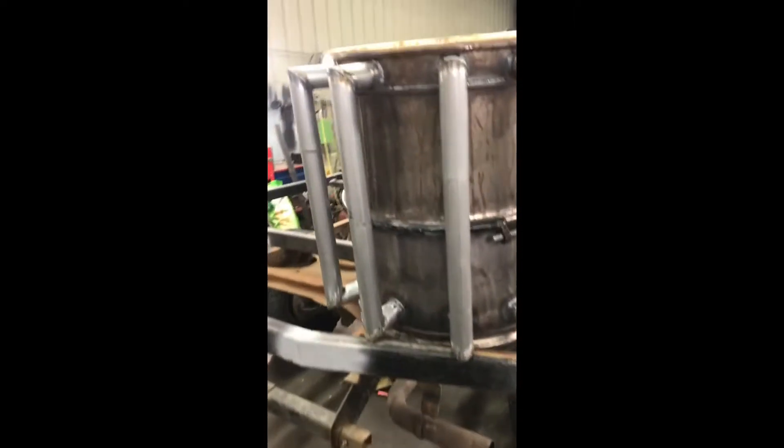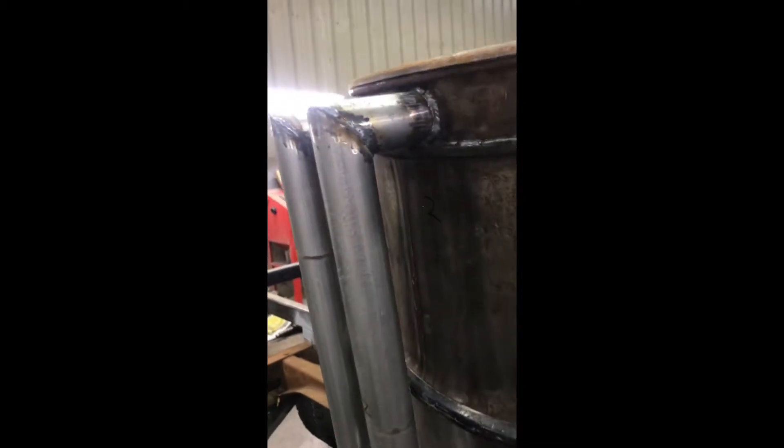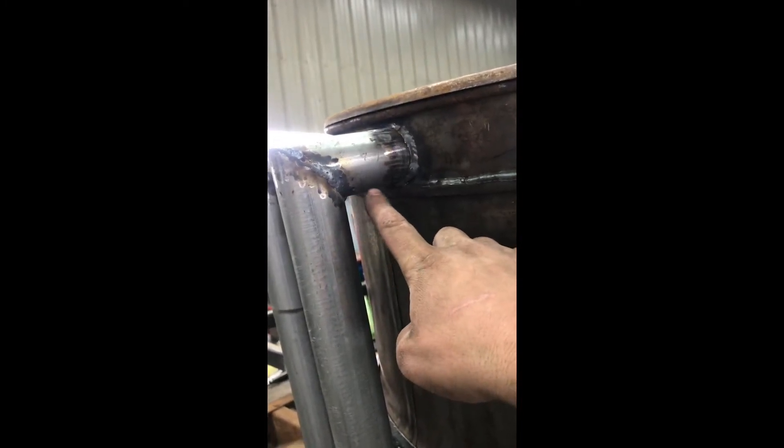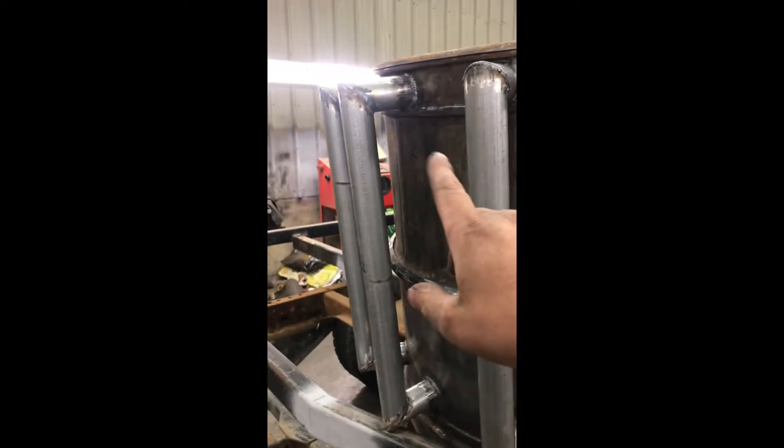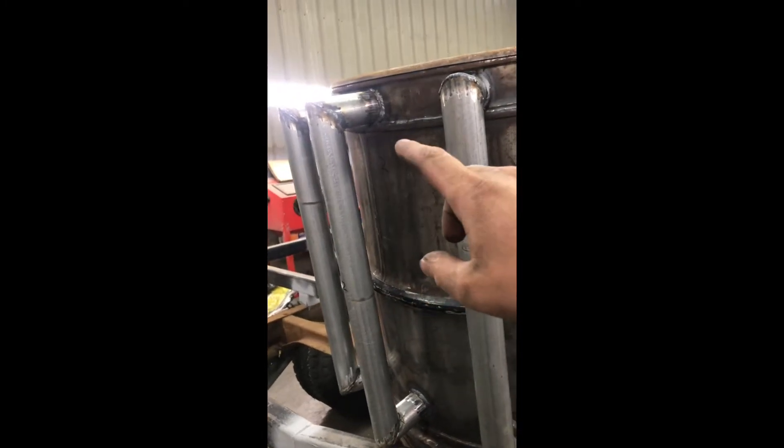Haven't turned the camera on for a minute. So there's the cooling tubes — 23 and a half inches long. I don't remember what the length out here was but I made sure underneath I had three and a half inches, so that'll give me plenty of room to snipe these off. The only reason I haven't cut them off yet is I need to get some radiator hose that's the right size to go over that.